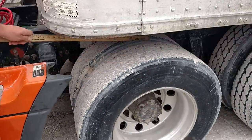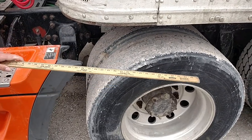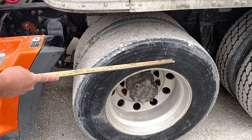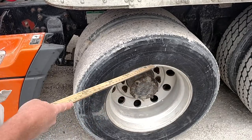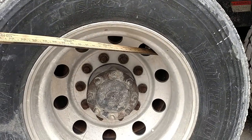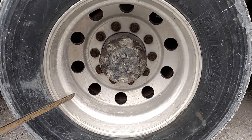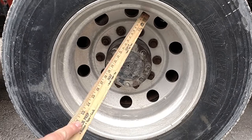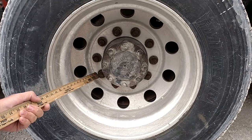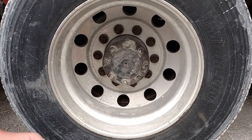Wheel assembly. My inner space is free of debris. Both tires on all three sides have no abrasions, bulges, or cuts. The tread is worn evenly — I should have two thirty-seconds of tread depth — and the wheel is filled to the proper level, factory setting, whatever it says on the tire. I would check that with a tire gauge at the valve stem, which should not be cracked or broken, not leaking air, and should have a cap. Both rims are mounted securely, not cracked or broken, no unauthorized holes or welds. Lug nuts are all there and tight, none are missing, and no signs of a loose lug nut like rust streaks or shiny threads. The outer hub seal is mounted securely, not cracked or broken, no missing nuts or bolts, and not leaking.